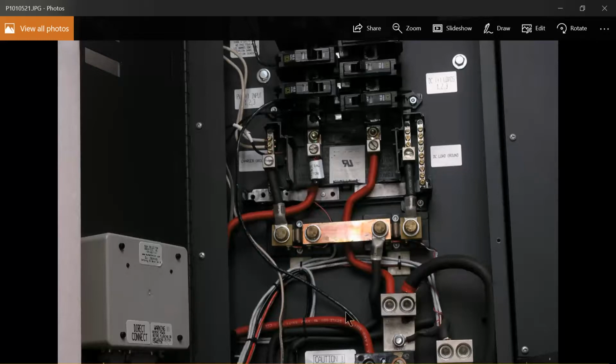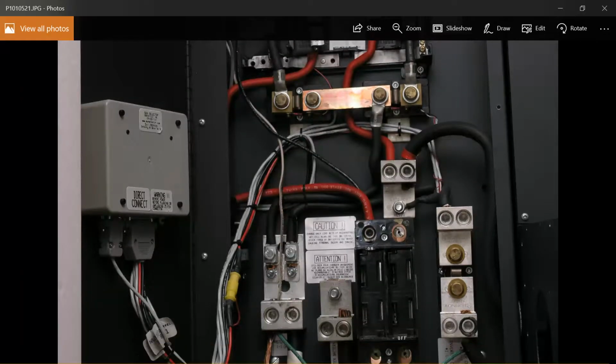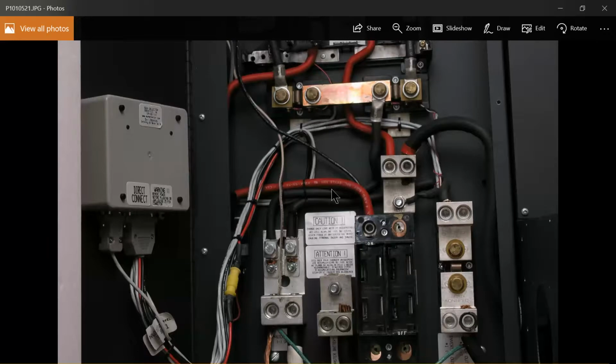So there's your battery positive, battery negative, PV negative. The next thing we would have to be doing is the connection for the shunt here. This is going to become the master shunt. And we would be taking this cable that currently goes up to here, and moving that cable over to the bottom of this shunt in this open port right here.